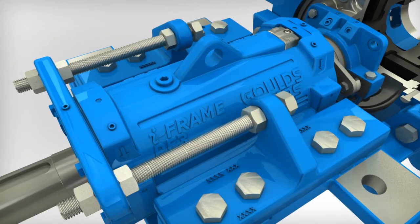Turn the outboard adjusting nuts to draw the power frame and impeller toward the volute liner. Turn the shaft clockwise as the adjusting nuts are turned to determine when the impeller contacts the volute liner. Stop when a firm drag is encountered.